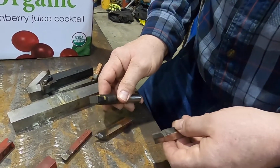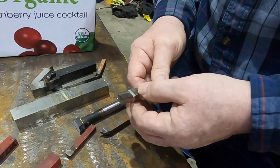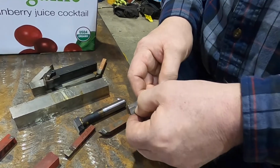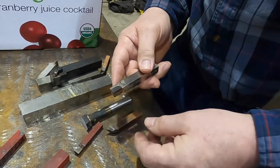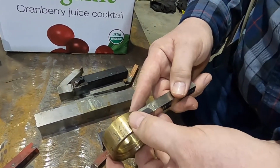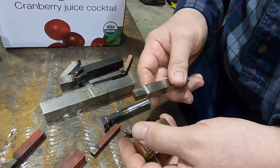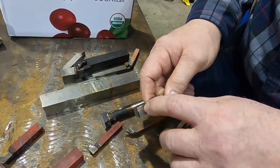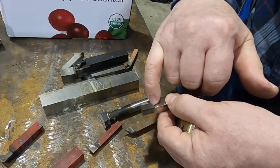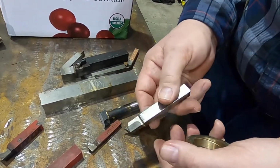What I have seen, and this is pretty much not done anymore because you don't do the level of production with brazed on tooling that we used to do, in old days, I have used these hard enough so that I would actually see the silver brazing in the insert glowing and starting to melt away. So I would be turning on something just super aggressive, no coolant, because the coolant in this situation was just more of a mess than what it was worth. Even though we're getting more wear on the tool, it would have been on something that was welded up, big radius on the front of the tool so that it didn't chip away, and just crudely coming in, probably a tool that was already half used up lengthwise too, so we're not heating so much carbide. But I've actually seen it where it was hot enough that the silver brazing was melting, and the only thing that was holding it was this shoulder that it was working against. And when you see that, you stop for a second, back off, and resharpen your tool, and you can save the tool.